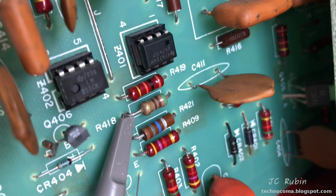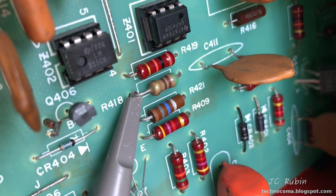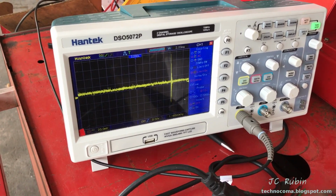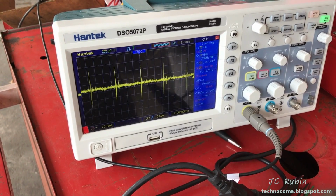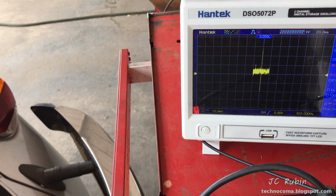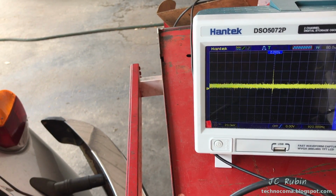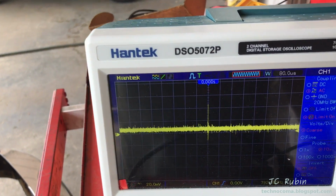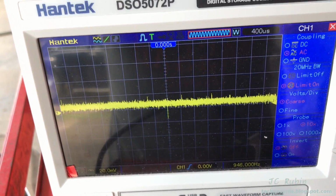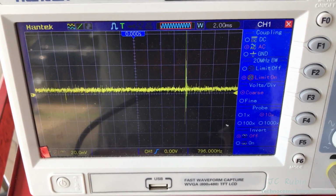Because I get through another 2 components, again, there's nothing that changes based on the switch setting, but since I'm walking it through, my next test point is going to be at the end of R418. So to get this next junction, looks about the same. This is primary, diagnostic. Triggering just right. It's very difficult to do. So with this, setting it to secondary, there's absolutely no difference whatsoever.